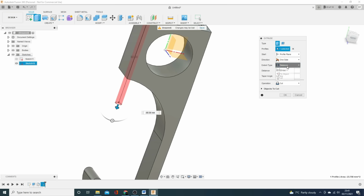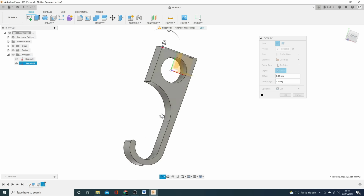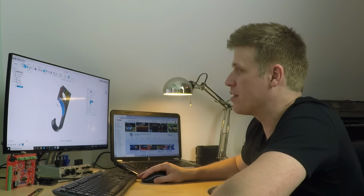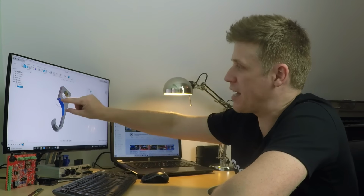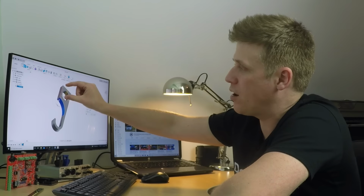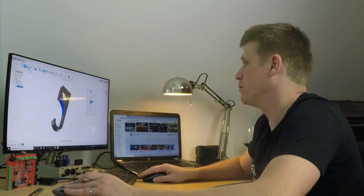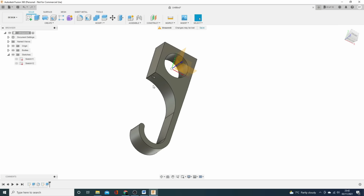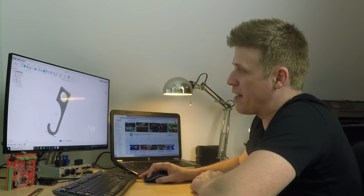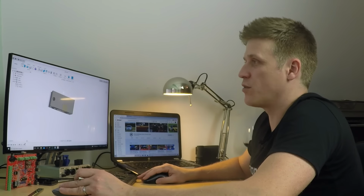But what I'm going to do is choose that cut extrusion to go until it hits something that I can specify. I want it to hit that surface. So however I change the thickness there, it stops there. It'll always go until it hits that surface. If I change that surface, I might need to come back and revisit it, but I'm constraining the extrusion to the model, which is also built on constraints. So you can see how things are logically getting stacked on top of each other. I'll click OK, and now we've got a 5.5 mil hole running all the way through the model. We can check it doesn't encroach into the hole there for the roll bar, and it goes all the way through. So it's time to do the same thing with the other sketch, the other circle.